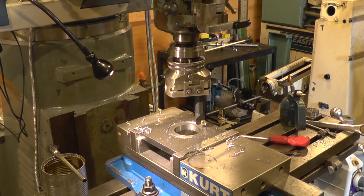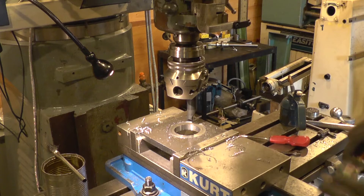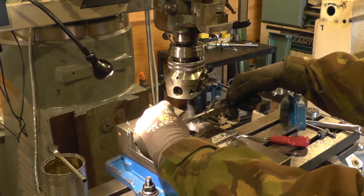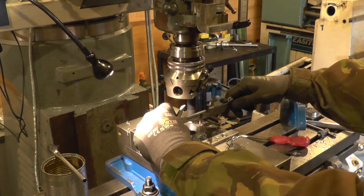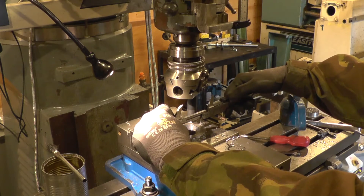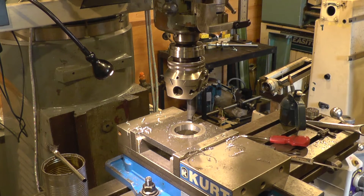Let's see what we get as a measurement. This is not a highly precise measurement — we just like it reasonably close. I'm getting 73.48mm, which is going to give us half a millimetre clearance on the register. That's a lot closer than the original setup. I don't know if I'm tempted to dial it in any closer than that — I think I'll probably leave it as is.